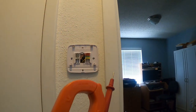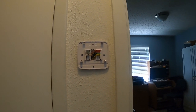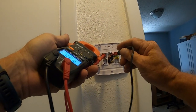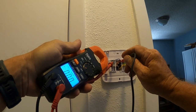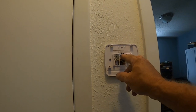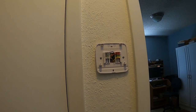The next step before we go any further is to kill power to this. We go out to the unit - there is generally always a disconnect at the unit to take power off, which will take power off the thermostat. We've confirmed no voltage at the thermostat - we're good to go. If you get hit by 24 volts, it won't hurt very bad, but the main risk is shorting to ground or shorting your commons together and tripping your transformer, which puts you in a different situation.